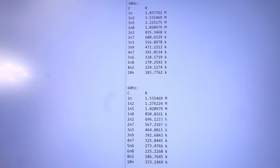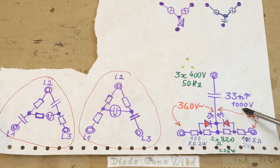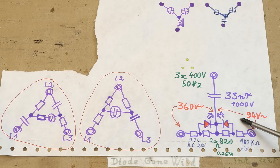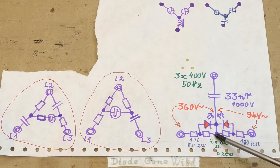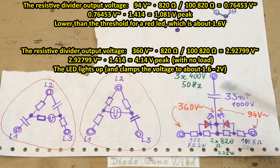I might copy the table into the description. I also came up with one more version using LEDs, one capacitor, and two sets of resistors — basically the same principle as the tungsten lamp version. Based on the rotation, one LED or the other lights up. There is a 33 nF capacitor rated at least 1 kV or 400 V AC, two 100 kΩ 2-watt dropping resistors, and smaller resistors in parallel to each LED. Each side works as a resistive divider, since this circuit doesn't fully cancel the voltage — it's just significantly lower on one side and higher on the other. We measured about 94 volts on the low side, so the resistive divider must bring it below the LED threshold, while still lighting it up at 360 volts.